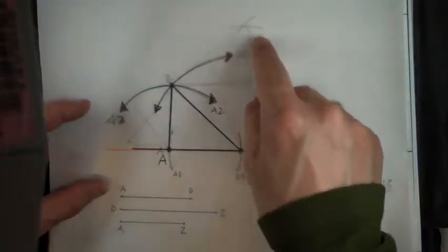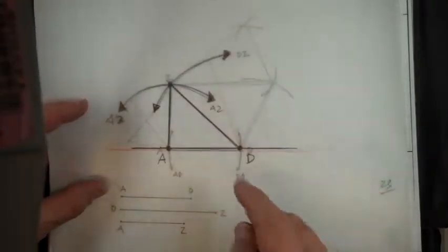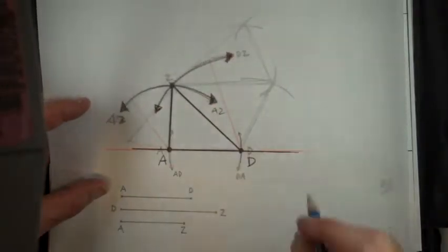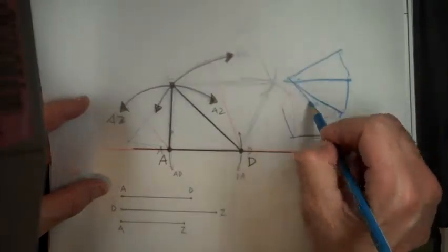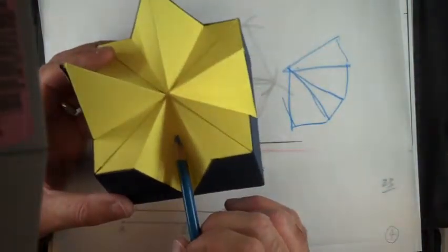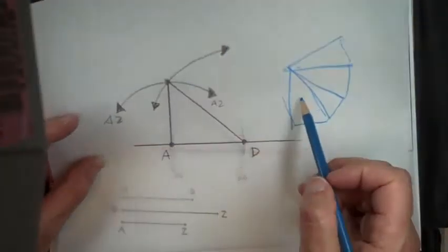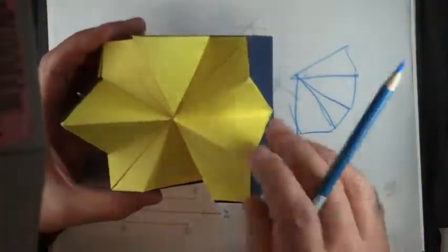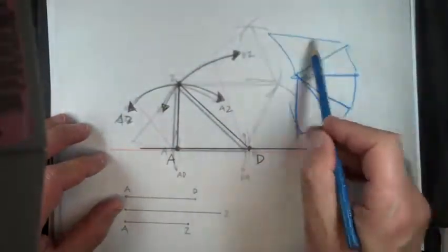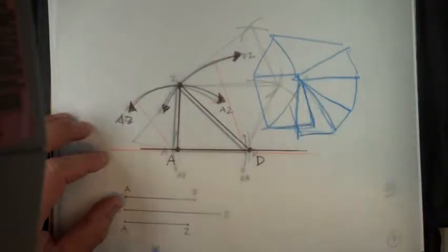To do the others, you just keep going, essentially, using what you know and then measuring what you don't know and moving around, so that in the end you have a shape that is kind of like a fan. And it's pretty much proven that if you have a convex shape like this and also concave shapes going in and out, you cannot make this entire surface out of one single piece, because sooner or later it would overlap. So what you have to do is make it out of different pieces.